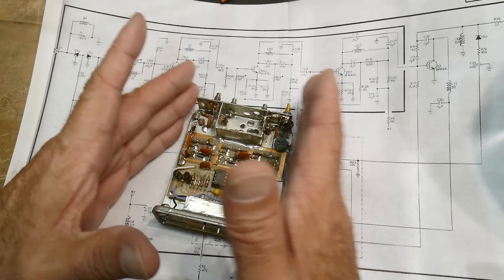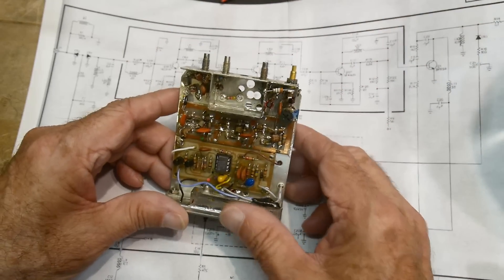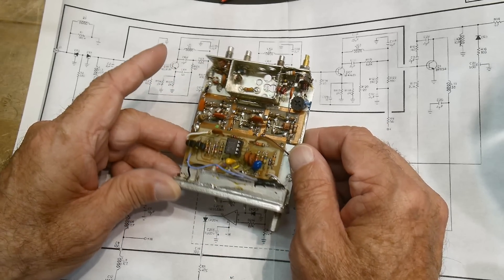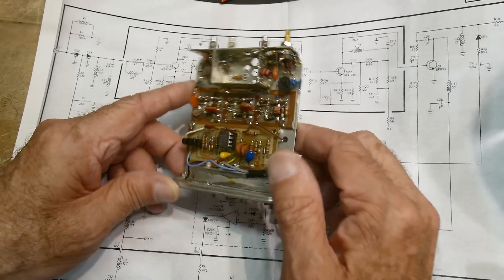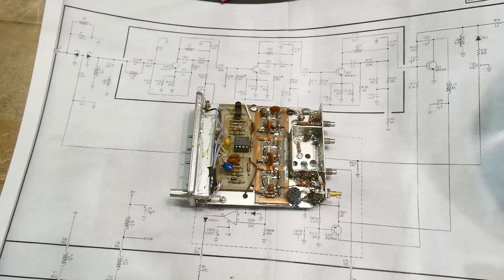So we're going to have to sort of guess a bit. I'm going to try to get this operational on the bench outside of the unit, inject a signal, look at the output, probe stage by stage, and see if we can figure out what's going on. We might also pull this op amp out to make sure it's working, though that wouldn't account for the symptoms, but it'd be an easy thing to do.